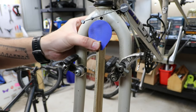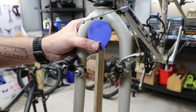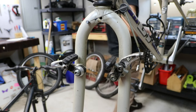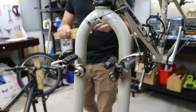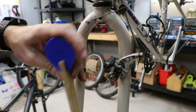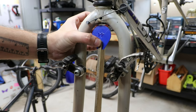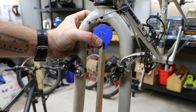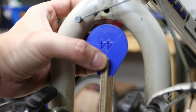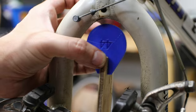Let's see what it would do if we put on a 29 inch rim with the same 54 millimeter tire. I don't think it's going to work. Nope, that does not work. So this fork will not accommodate a 54 millimeter tire on a 700c 29er wheel. But what size would work? Let's go down to 44 millimeters. Would a 44 clear? Yes — not a lot of extra space, I feel like that's cutting it a bit close. But indeed, a 44mm even on a 29er or 700c should work.